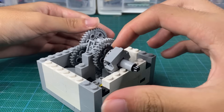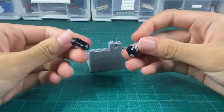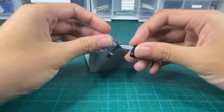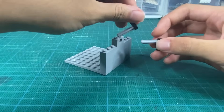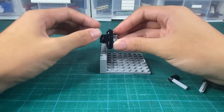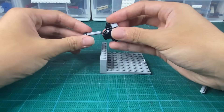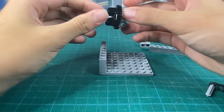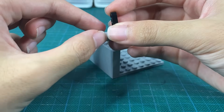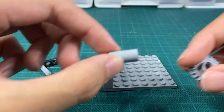Wait, but what is that weird spinny thing I just made? It's that time of the video again — the clock hands mechanism. If we have two different clock hands, this is the minute hand and this is the other hand, and we want them to both rotate at different speeds on the same axle. My first candidate is this weird gear piece — you could put it here and have it rotate like this, with an axle running through the middle. It's quite bulky so I'm going to keep looking for more options.